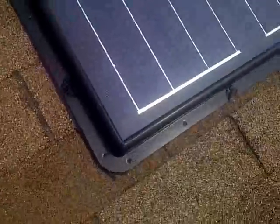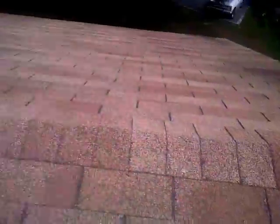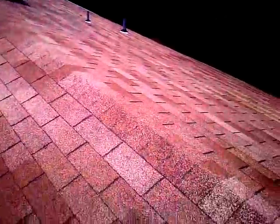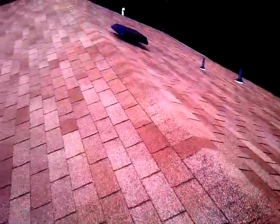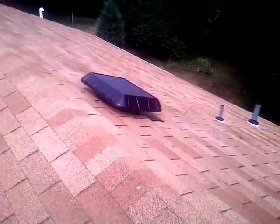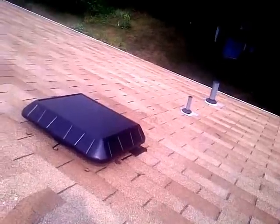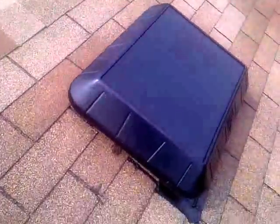I used a 20-year sealant, so there'll be no problems here. Looking at this roof, you can see there's no ridge vent, so this home has no ventilation in their attic. They have two gable vents but they don't do much. I've been up in the attic and it's just stifling up there. So I suggested to the customer that they install one of these — it'll ventilate the attic really well. We just installed it about an hour ago and I wanted to show you how we do things.